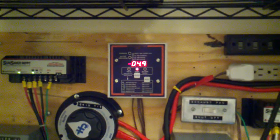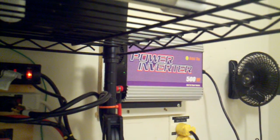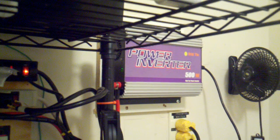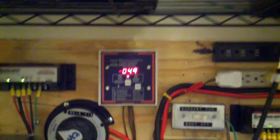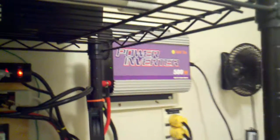It's 472 watts — 4.9 amps from the grid-tie inverter tied to the battery bank, and this is at the four-hour mark. I think it's pretty efficient. I could definitely deal with 4.9 amps at midday or solar noon coming from the battery bank, so I think we're good to go. Thanks a lot YouTube.